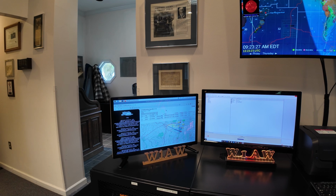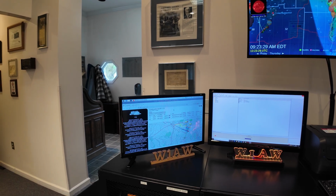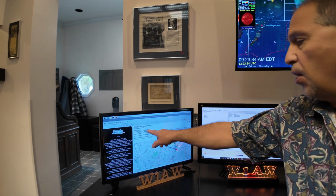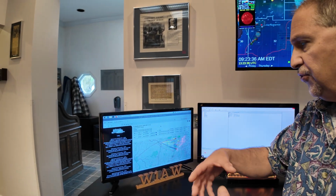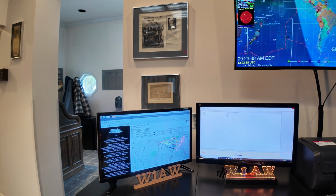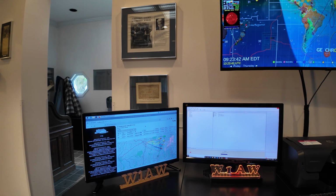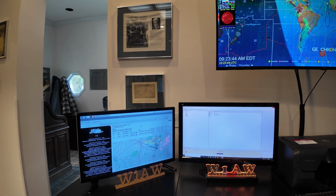Okay, cool. Well, very good. And all running on a Pi. There are actually 2 RTL-SDR dongles sitting in a box with the Pi running into it. And for this particular system, I'm using very simple dipoles cut for 400 megahertz.